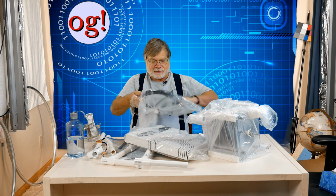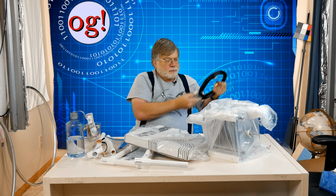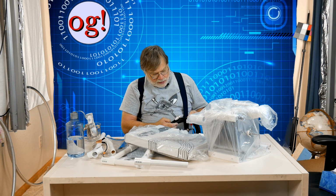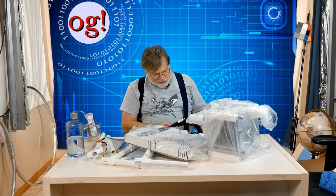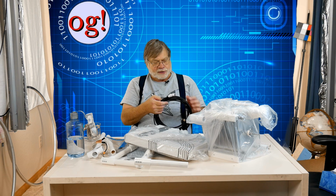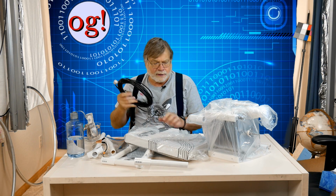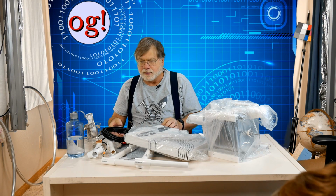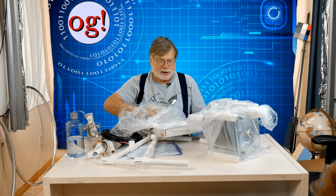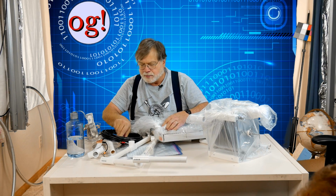And this is the feed line, which is BR240, low loss, 50 ohms. That's from Browning. So this would be the equivalent of LMR240 or RG8X. Okay, and we keep going on the opening.